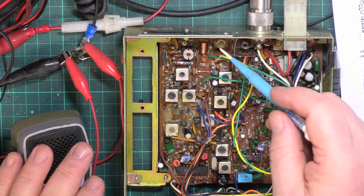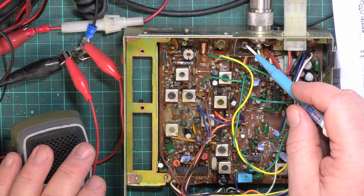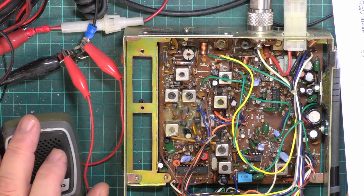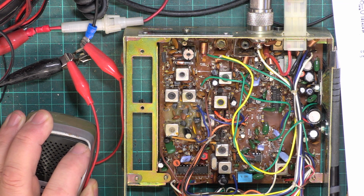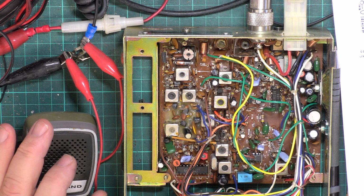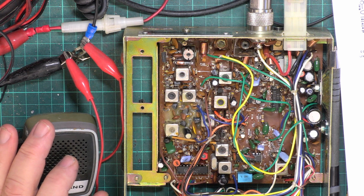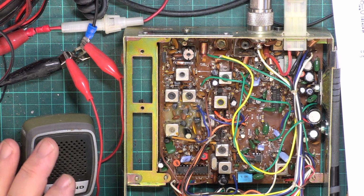They're often, when they're in that position, they're often the 54 meg trap. Well, it isn't in this case, and we now have spot on at 4 watts. That's the maximum the set is wanting to do. So there we are. We've got 4 watts on this test set, which is quite selective. So if you put that on a general meter, it probably read a little bit more.